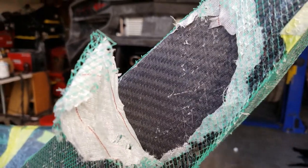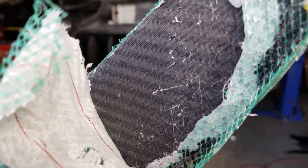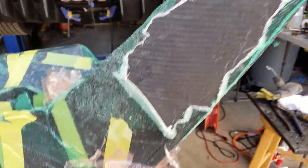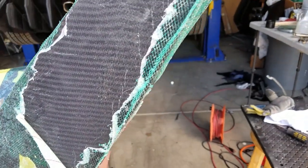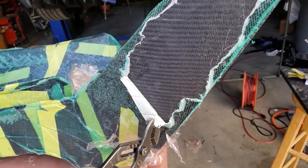If you start getting black, that's bad — you're starting to cut into the carbon fiber, and this layer of epoxy is actually quite thin, so be really careful. I'll start peeling this back with the pliers, and that's why I like the channel locks — I can peel it back like that. When it pulls up, I'll cut that with the X-Acto knife and keep running it down. When you get a significant chunk peeled back, cut it off so you can get the pliers back in and start the peeling process again. Just keep cutting and going along until you've got most of the part.